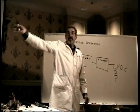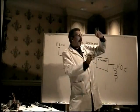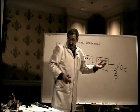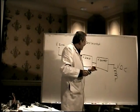When you have a horizontal line on the screen, which is total loss of vertical deflection, of course, first thing, we know it's not the power supply, the horizontal, the video, it's none of that. We know it has to be something in the vertical circuit. And that's the first thing you suspect.